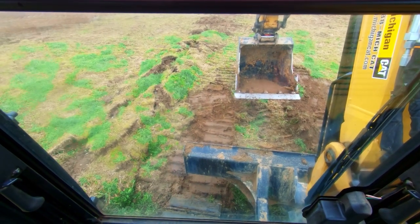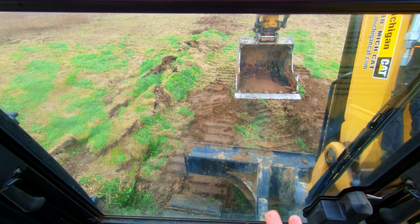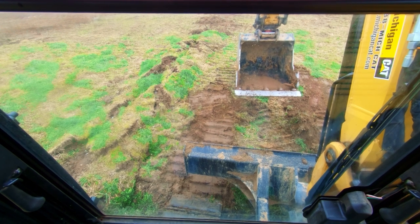The moral of the story - the gist of this entire video - is you've got a giant shovel right out there in front of you that doesn't just have to be used to load trucks. You can use that arm to do all sorts of things to make a space for you to operate in. In my excavator tips and tricks videos, one of the things I talk about is using your bucket to smear the pile away from your counterweight so you aren't rubbing it on the pile. This excavator arm is a tool not only for the work you're doing, it's also a tool for setting up your workspace. If you have any questions, drop a comment below - we'll catch you guys on the next video, have a good one!